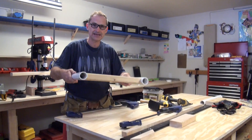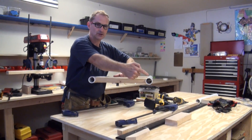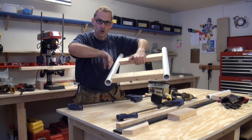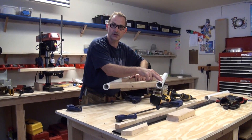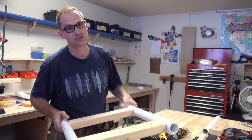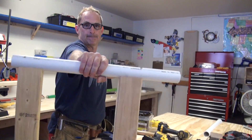I'm going to go ahead and say it: I've built a lot of PVC track, and this is the strongest and best piece of PVC track I've ever built. If I was going to build another PVC roller coaster, this is exactly how I'd do it — 18-inch gauge rails starting with 15-inch long two-by-four ties, a one and seven-eighths inch hole saw to cove the ends, screws at the 45-degree mark on the outside of the rails so wheels avoid them, and three and a half inch T25 deck screws. Schedule 40 one and a half inch diameter PVC — that's how to do it. Who knows, maybe I'll make a lot more of it now that I've got this awesome method. Thank you for helping me bring physics, family, and fun to kids everywhere.